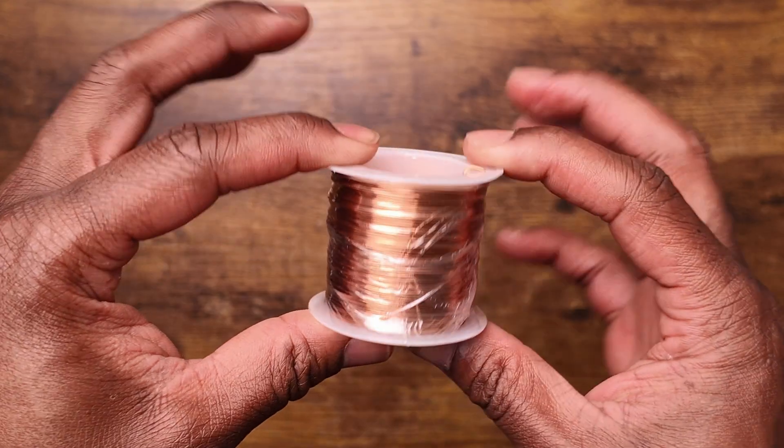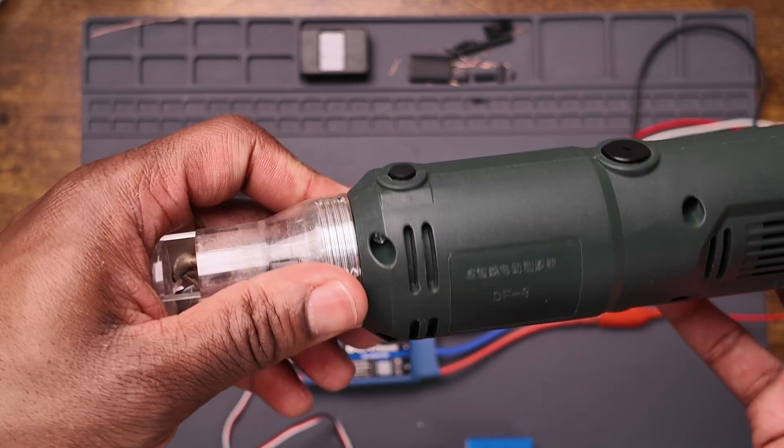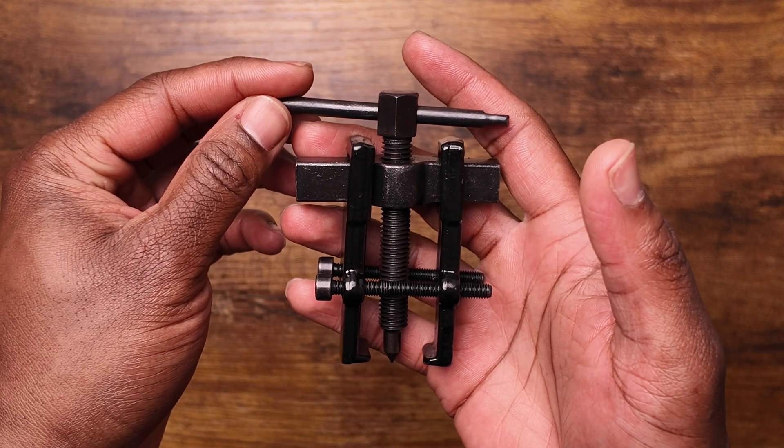The more detailed list of things I needed was a little bit long — not really, you'll see. I needed copper wire, but it had to be the exact same size as what I removed from the motor, it had to be enameled, and because it's enameled it has to be stripped. To strip it I needed a wire stripper, which is where the DFA comes into play. The copper wire needs to be stripped so you can solder it back onto the wire leads. I also needed a gear puller to remove the base from the stator.